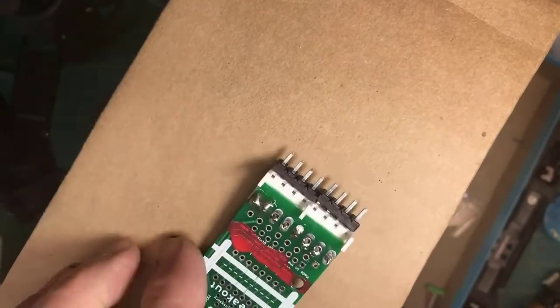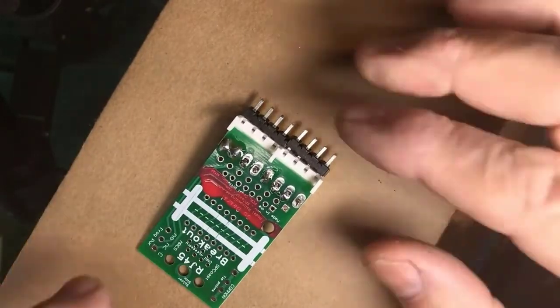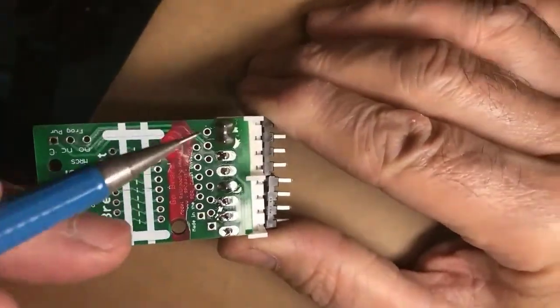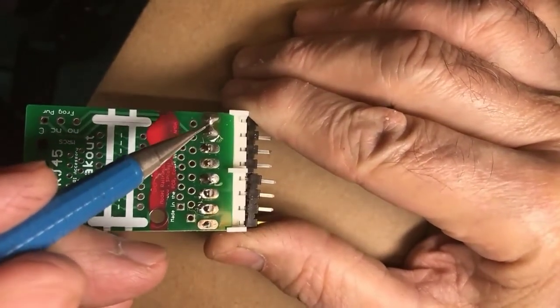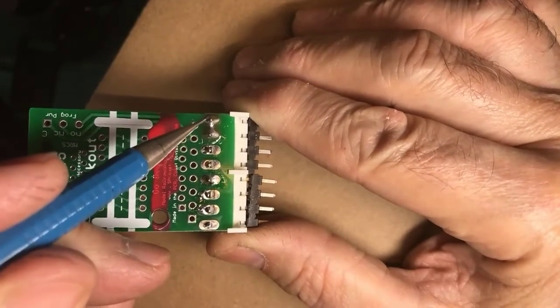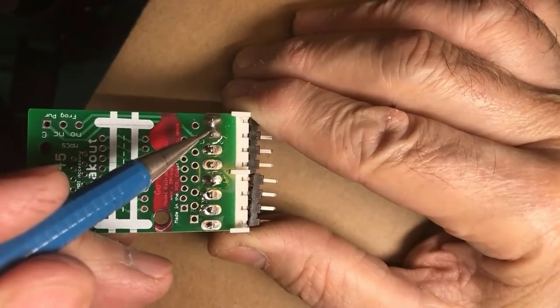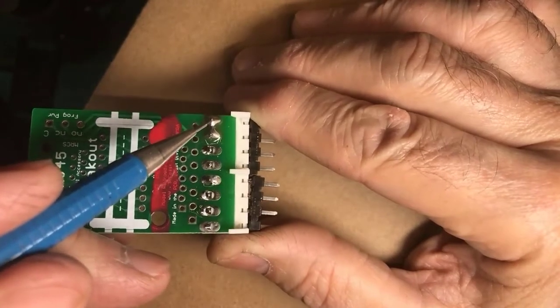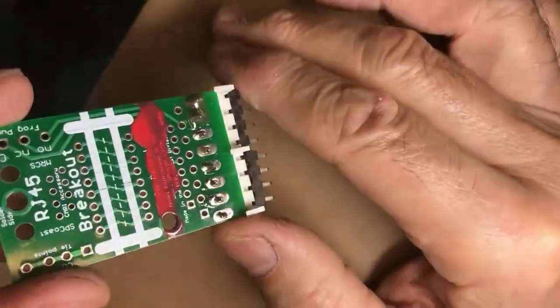My go wrong demonstrator is this guy here. And it shows some of the popular failures that one can have. All right. You notice how the solder is going between the two traces? Got excited, poured too much solder in, and the solder went across and connected to the other trace. This is called a solder bridge and obviously is not going to bring happiness to anybody.